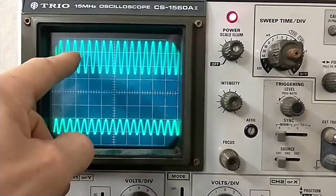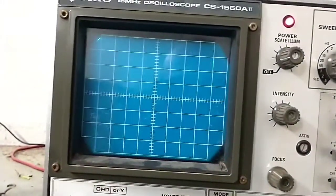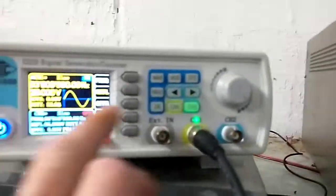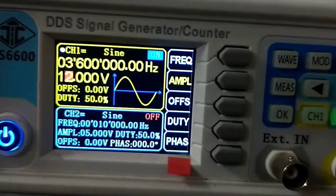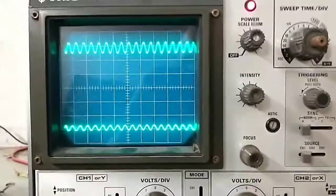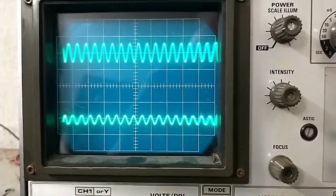We have the positive here and the negative here. What I want to do is adjust this magnet as I look at these waveforms. You can see I can actually adjust the mean voltage even further apart. Now that's gone out of range, I'll reduce the input voltage to make this more manageable. There's a 12-volt peak-to-peak input, and I will now adjust the magnet. You can see I can adjust to resonance, but also the mean voltage.